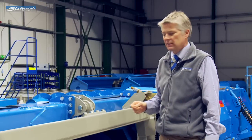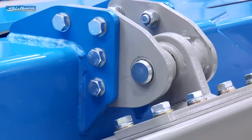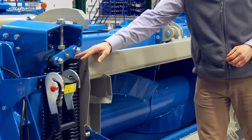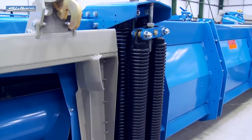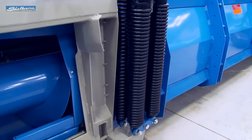All XCV machines are center mounted on the combine. The center mounting makes them ideal for controlled traffic applications. All XCV machines operate a lateral floating adapter plate, which is spring loaded. The inner springs on the right hand side are used to bring the header level to compensate for the extra weight on the left hand drive end.